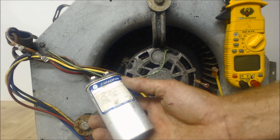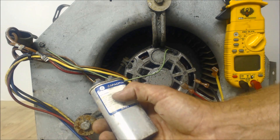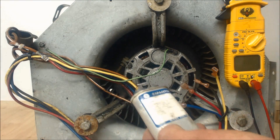If this was a 440 VAC cap, then all you could do to replace it is a 370/440 or a 440. You could not put in a standard 370 in there. Anyway, let's go ahead and get to it.